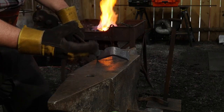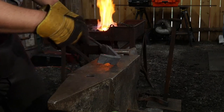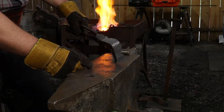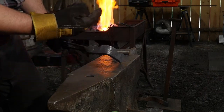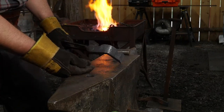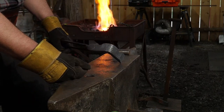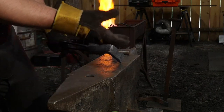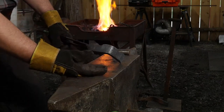So you've got to understand the material itself. Say you make an axe, and you forge welded it all together, and all of a sudden you might see a crack in the grain or a little delam or something like that. That is perfectly natural in historical context. It's something they might have addressed with a little extra welding. They might have brazed it shut and then filed it if it was really an eyesore. Otherwise, if it was on a piece of equipment, it was acceptable. It was like, well, that happened. It was not a failure of the material, it is a characteristic of the material.